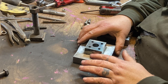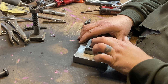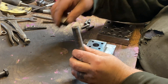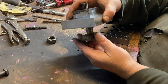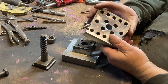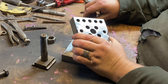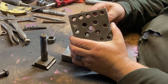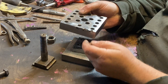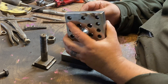This is what I ended up coming up with: I welded this down to the bottom plate, drilled four holes and tapped them, drilled the hole through for the center T-bolt that goes through — that's what holds it on the cross slide. I also drilled out the center for that bolt and drilled and countersunk holes for the bolts. Now we're going to bolt this onto that and then run the bolt through the bottom, and hopefully everything will work out right.